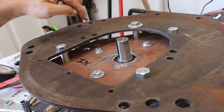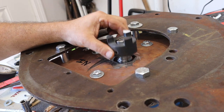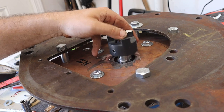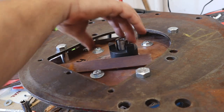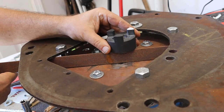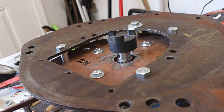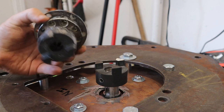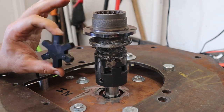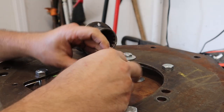With the motor plate in place and the bell housing plate bolted to it, we need a Lovejoy connector, and exactly where it sits matters. The measurement indicated the back of the Lovejoy had to be even with the back of this plate, so I stick a straight edge through to get it to that height, line up the keyway, and that should be where I need it. On top of that goes the coupler from the Lovejoy to both sections of spline, with a rubber spider between the two parts — hopefully that also helps take care of any misalignment.